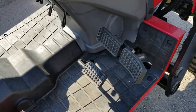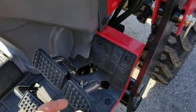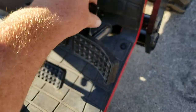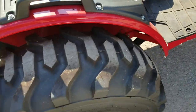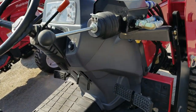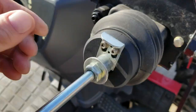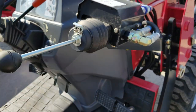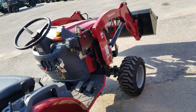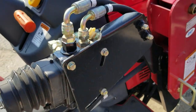You've got a two-brake system. So if you're using cruise control out in your fields and you want to make tighter turns, just tap one — these are independently braking on each of the rear wheels. On both tractors, the loader handles are the same. You can lock them down so if you have a load in the air, you can lock it down. You can also adjust these up and down a little bit, as you can see right here.